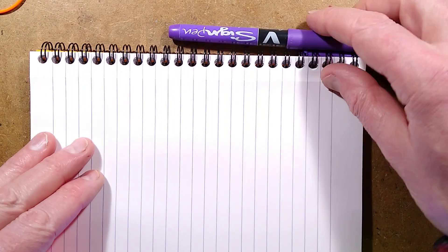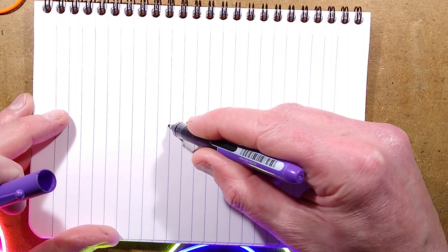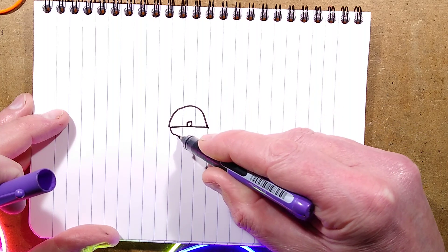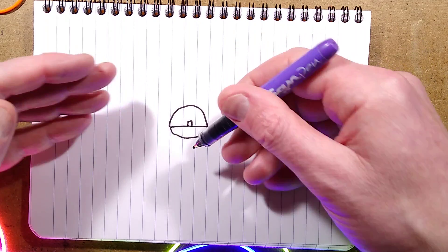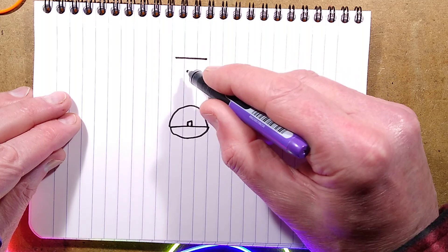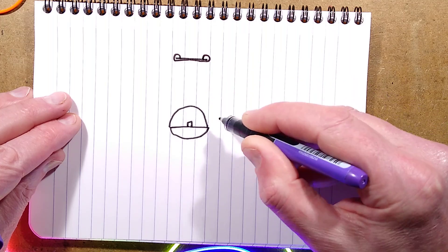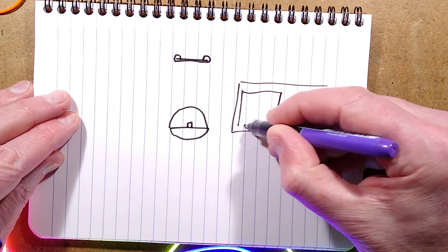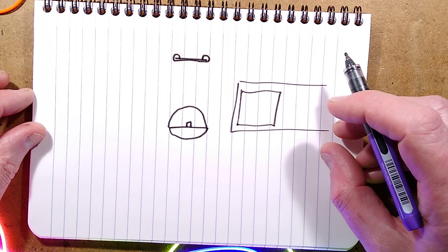This arrangement means the whole filaments operate at just three volts because all the LEDs are effectively in parallel. The construction is: a circuit board with tiny chips mounted on it, coated with a phosphor-loaded gel on one side, and slightly less phosphor-loaded, more translucent gel on the other side. Any light bounced off the top also passes through the circuit board and comes through the bottom. To terminate the strip, a crimp is put on the end — a little crimp that folds around and bites into the copper pad. Then it's secured with a blob of silicone and covered with phosphor-loaded silicone. It's very neat.